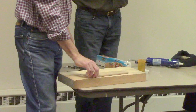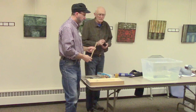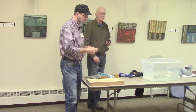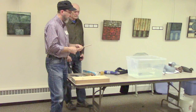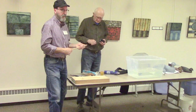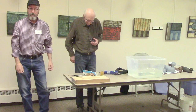You certainly could make it out of wood and bend it. You could take a flat piece of oak and just draw the curve in it. This is a half-inch oak dowel that I used for my bill. It did crack on me a little bit, and what I did was — after it dried on a bend — I soaked it and saturated it in superglue, multiple coats of superglue, and just let that dry up. Then I shaped it down with a file and a grinder a little bit, and it worked out fantastic. That superglue just glued it and sealed it right up — unbelievable — and hard. That'd be for shorebirds. I made an eight-inch bill for a curlew.